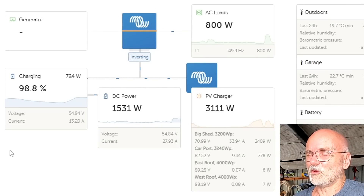Let's turn off the shared voltage sense again and put all the solar charge controllers and the smart shunt back into the Bluetooth smart network. They'll communicate with each other, acting as one solar charge controller, and get voltage and current readings directly from the smart shunt - this is basically the same as the voltage sense, just better, because we won't have this issue anymore. I'm not sure if this is actually solved by connecting a smart BMS. Tell me - how does your system react when you have multiple MPPTs connected with a smart BMS?